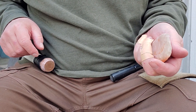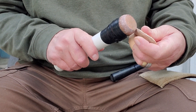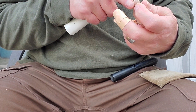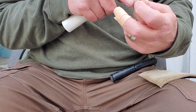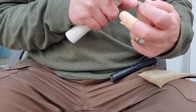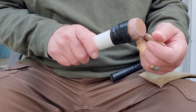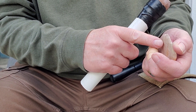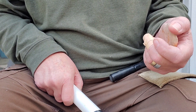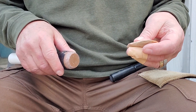I'm going to run down this way with the finger up on the ridge. When I hit, I'm going to hit almost straight into the piece — the force directed mostly inward, just a little bit outward. You don't have to hit super hard or fast once you've got an isolated platform like this. It ran up there. I took off more of a chunk there than I wanted to, but that's okay.